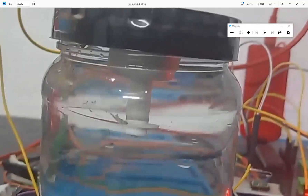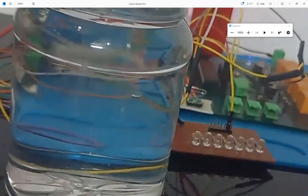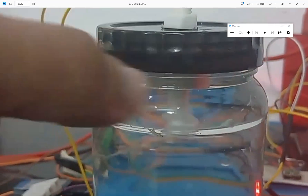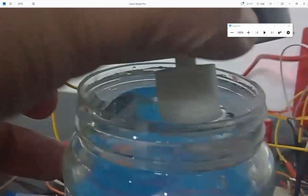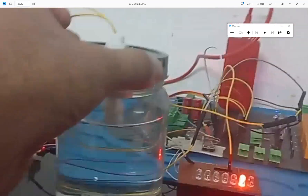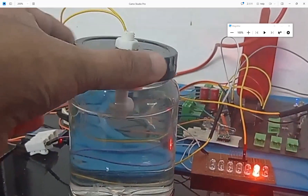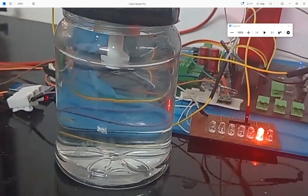From this angle you can see the LED is on because the sensor is submerged. When I take it out slowly, the moving part goes down and the LED turns off. As soon as I put it back in the sensor gets submerged, the knob goes up, and the LED turns on. The moving part going down means the circuit is disconnected and the tank is empty; going up means the tank is full. So guys, this is it. If you have any questions, ask in the comments — thank you very much for your time and see you in the next video.